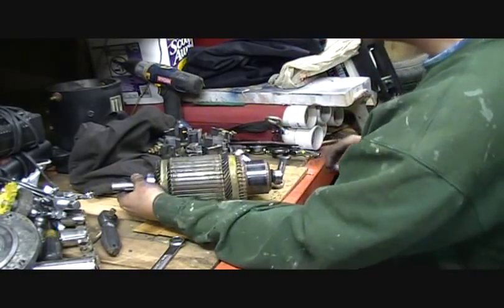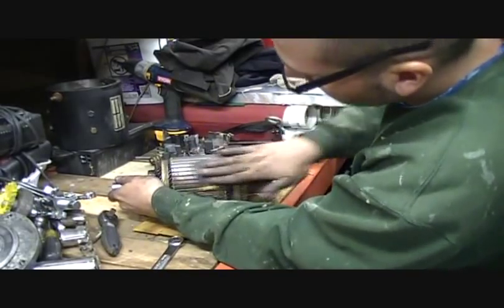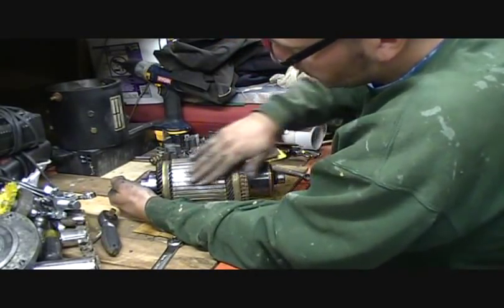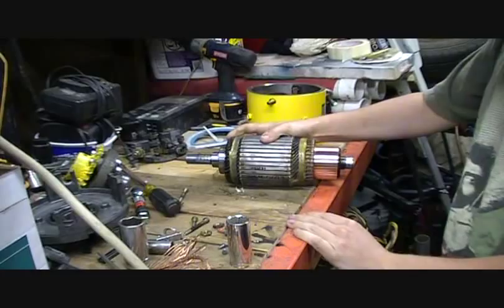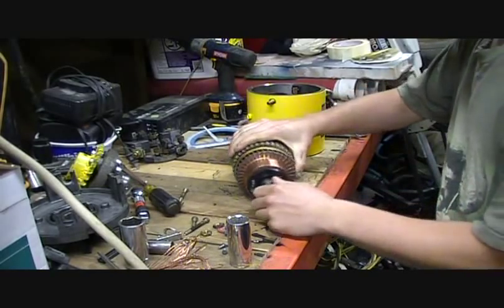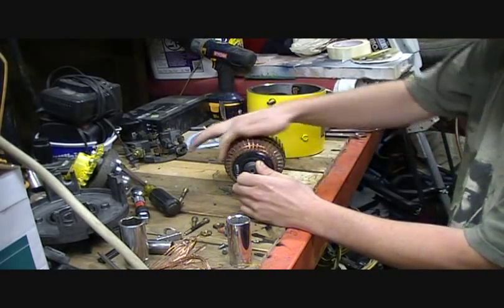I was experimenting with a little bit of sandpaper, and without much effort that's going to be perfect. There's no contact here obviously, so just cleaning them up. I'll spray them with a little — alright, I just got the commutator cleaned up at the machine shop down the road. They did a really nice job. It's extremely minimal burring in here — so minimal that I'm not going to even do anything about it; if I do, I'm just going to take this out of true.